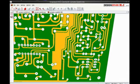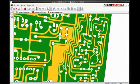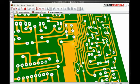I've also spent some time with a little bit of screening on the back, a little bit of ground shielding, in between the high voltage section over here, which is generating the preliminary voltage, just basically to tickle it, to get it to run for testing so I don't blow anything up, because the voltage on this is capacitor coupled, so it's basically like a voltage ladder and diode pump.